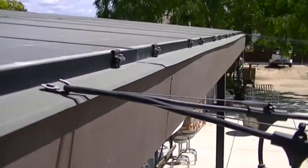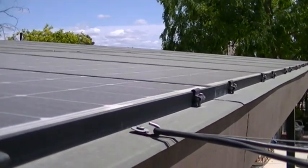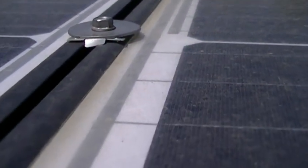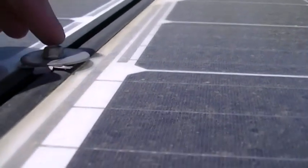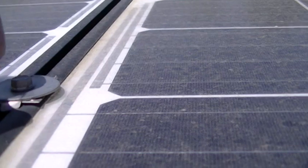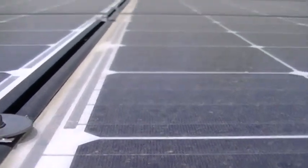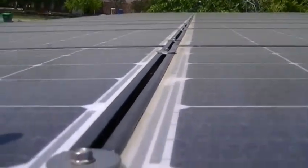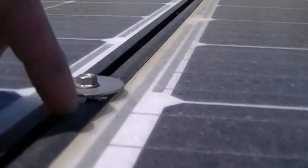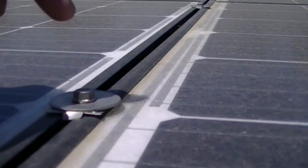From down below you really can't tell it's a solar system unless you look up underneath, but you get a great patio. Here are the mid clamps that I make — I use a stainless-steel quarter-inch tek screw through a stainless-steel bridge washer and a grounding weeb. The gap here looks like about three-eighths of an inch; I can go as little as three-eighths and I like that better than half-inch, though half-inch gives you a little more adjustment area. Because we got the diagonals perfectly square, you can maintain that three-eighths gap down the whole line with no problem. This design has been approved by the cities and counties in this area of California.